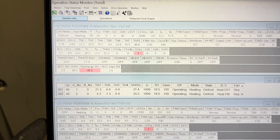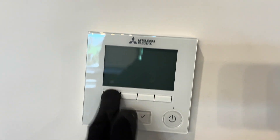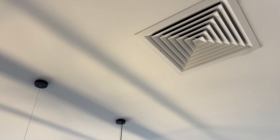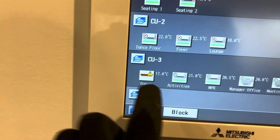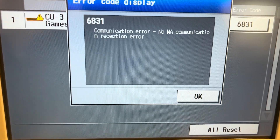Just had a quick glance and yeah, we're going to have major problems on this side. This is our culprit right here. I'm looking for access to the indoor unit and there's nothing, so I'll find a manhole. Here's our A200 — so the pool room was not in fault, it's basically just a communication error. It's not getting any communication from that controller.